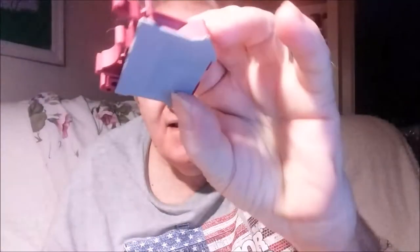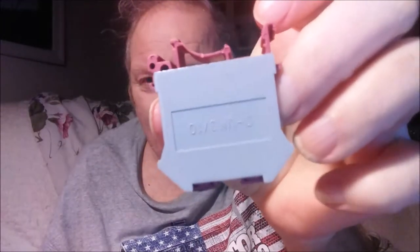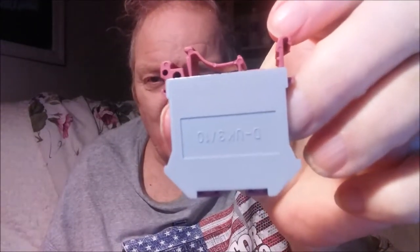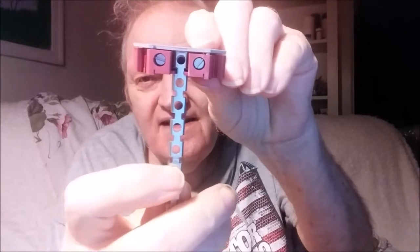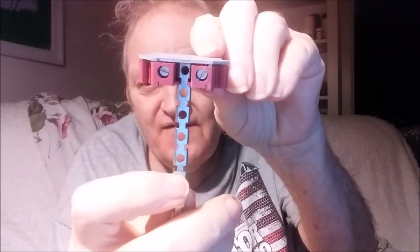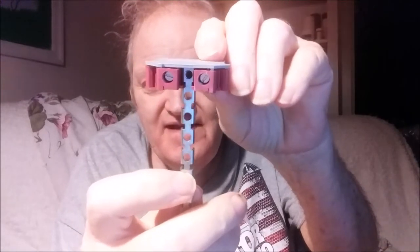Wherever you change from one wire to the next — like going from the black one to the red one — you snap on a cover. It's got like four little pins that fit into the back of the terminal block. When you have that in there and put your connector piece in, that insulates this block from the next block, so if there's a 220 volt difference it won't just be a dead short.